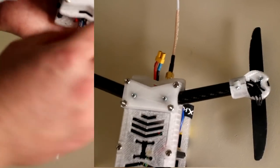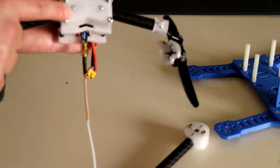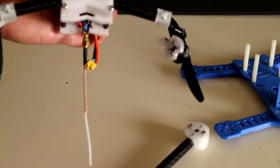This plastic clamp here just clamps right down onto it, but in a hard crash what I've found is the arms will rotate. So I've just drilled a small hole and I'm using M2 screws here for the time being to keep the arms locked in, and that seems to be working quite well.